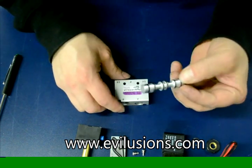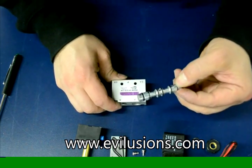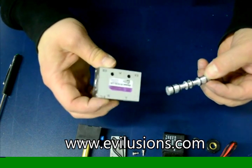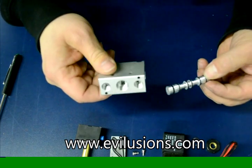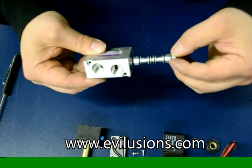All these O-rings are what actually do the sealing and keep the air going in the correct direction. If they get worn, dry, or full of water, you can replace them as long as the aluminum is not broken or damaged. Just replace the O-rings, re-lubricate them, clean the block out real well, and once you do that, you can reassemble it.